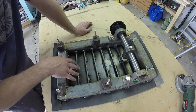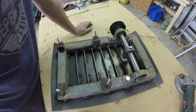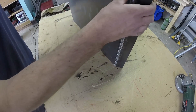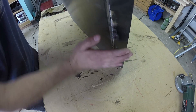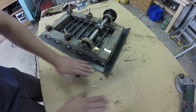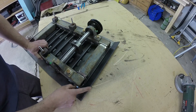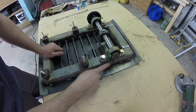You can see all the ribs welded in here now, so that's supporting the plate across the middle. I think that's probably adequate - even if the plate did bend a little bit I don't think it's going to be the end of the world as far as packing is concerned. The next thing I did was take the plasma cutter and gouge most of the way through the plate here and bent up the edges. That's going to give me the ramp I need when I'm pushing the packer back and forth. I'm going to weld these up and also make some triangle reinforcement pieces to support the front edge and triangular supports on the side edge.